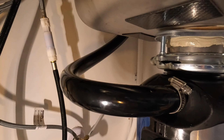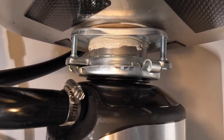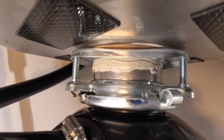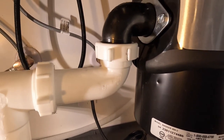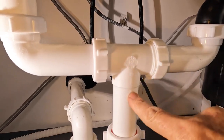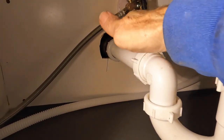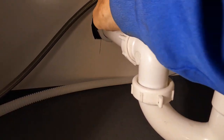Then you can make these turns, otherwise you're really going to be struggling. This flexible pipe must always go downhill, otherwise it could possibly cause a clog. Here we have the junction for the sink and the garbage disposal — you see it's got three screws that you screw up, and you see the plumber's putty oozing out there, which is the way it should be. From this portion that comes from the air gap to the disposal, it comes out here with an elbow to a one-and-a-half-inch PVC elbow. There is a baffle in this tee that keeps flow from going all the way across, and it comes down to the P-trap. Then that goes through this straight pipe — you need to angle it down this way a little bit, not too much, but I have this going downhill slightly.